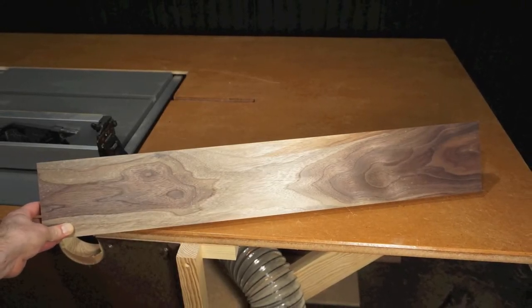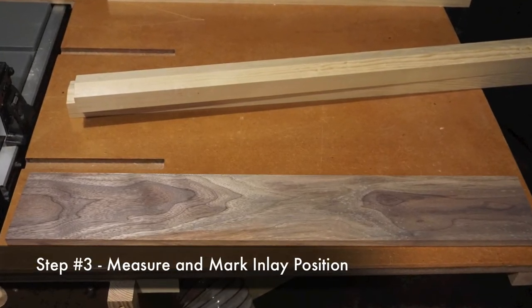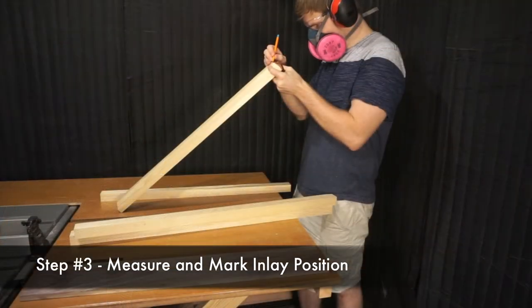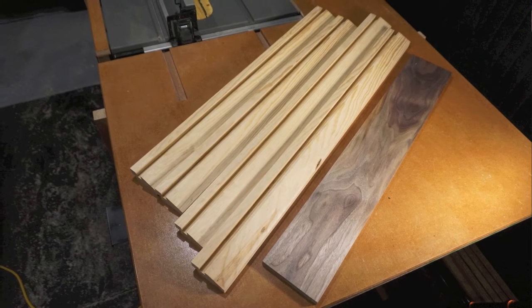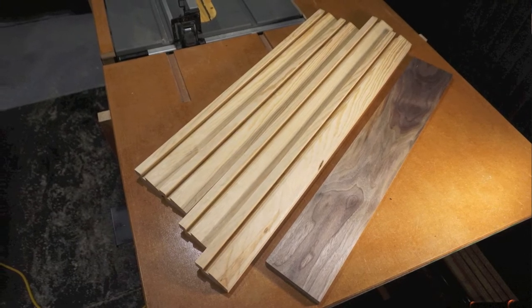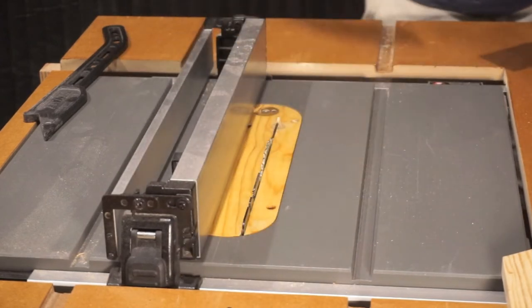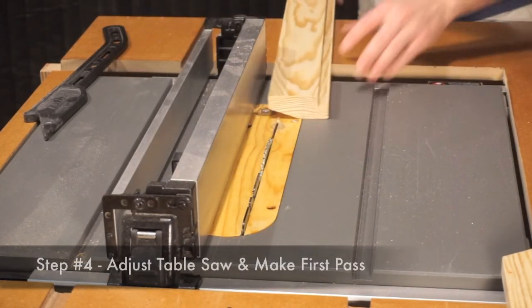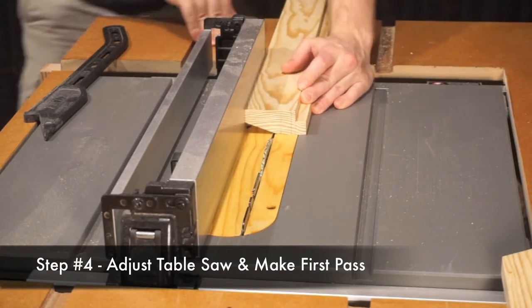After milling, this piece of walnut looked incredibly beautiful. The next step is just marking where I want the inlay to be within my frame. Here's how the inlay looks after cutting them out. The first step in cutting an accurate inlay out on the table saw is to make sure that you have your blade adjusted to the height of the depth of the inlay.